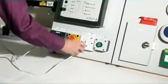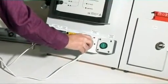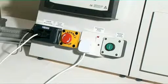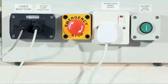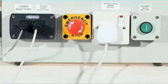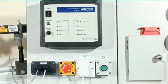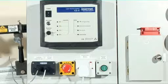Interface type 3 is the interlocked mains supply. A laser can be plugged directly into this interlocked output, with up to six amps available at mains voltage from the standard ICS-5. Upgrades are available to operate more shutters and interlock connectors, or for higher current interlocked mains.